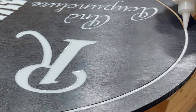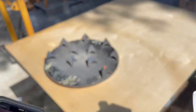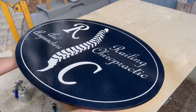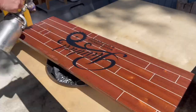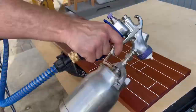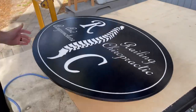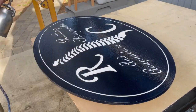Final result - we're going to put this in there really slowly and it worked out really well. For finishing, I love Halcyon Clear by Total Boat. I'm going to use the clear to build up a few coats, and then my last coat will be a matte finish. I set a timer every hour - you can put coats on every hour. I'm doing three coats of gloss then one coat of matte. You want to apply it a little heavier than you might think. After spraying with my HVLP system, it looks like orange peel, but Halcyon is like magic - within about 20 minutes it will self-level and become glass smooth.